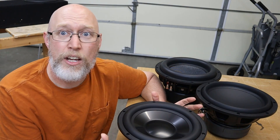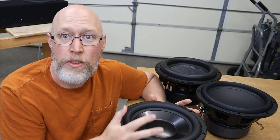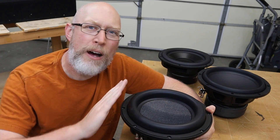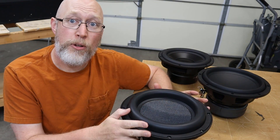The reference series is designed for sound quality. They designed it to keep inductance down so that it plays really well in a three-way system. The reference series is their low distortion subwoofer line. If you're looking for a sound quality subwoofer that can handle a lot of power and still get loud and low and nasty, the reference is what you want. Now for the Ultimax — the Ultimax is an entirely different animal. The Ultimax is all about hitting those ultra-low frequencies; this subwoofer really shines in a home theater setup. Go get the 18, throw a thousand watts at it, put it in a huge enclosure and tune it at about 15 hertz, and you'll have a fantastic driver for those low frequency effects in your home theater. It also works great in a car — the power handling is good, the excursion is good, it's got that high roll surround and a ton of excursion. Even though it can do all that, it still plays some really good sound quality.